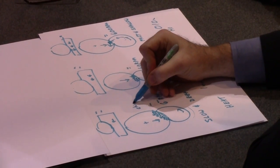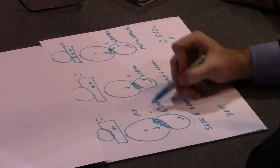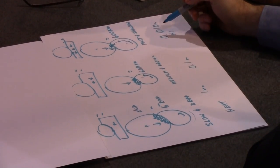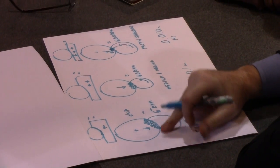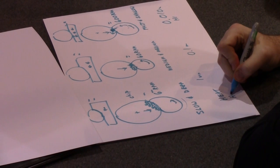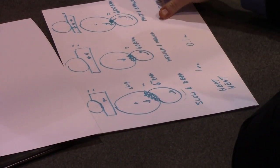Reason number two is, if we have 6 grits in the action as opposed to 1, what is our chip thickness or chip load or aggressiveness going to be? Are we going to take a bigger chip here or a bigger chip with the fast and shallow? I would think you'd take a bigger chip over here. You have to take a big monster chip with this one little grit, so it's going to really dig in deep. We take a big cut, we form a chip, we don't generate too much heat. With these, we form a chip, but in the process, they rub and they rub and they rub. So rubbing generates a lot of heat. Reason number two, we generate heat. So we have more heat for two reasons over here.